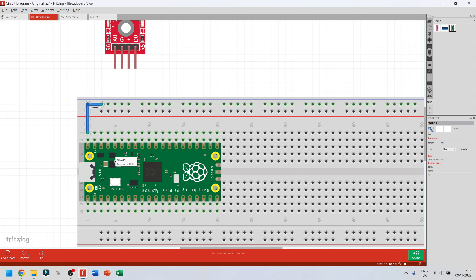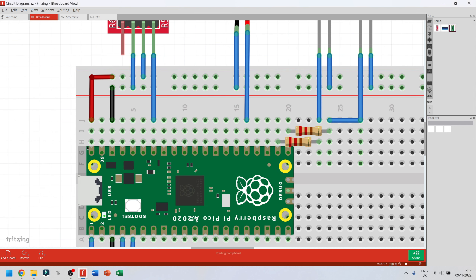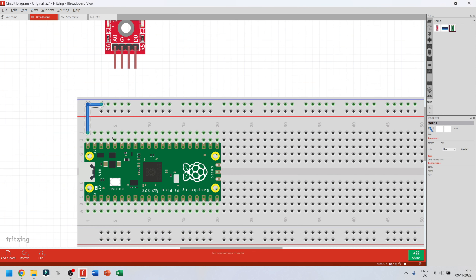I'm going to do exactly the same thing for the ground pin. The ground pin is the third one in from the USB port — one, two, three. On a breadboard, everything is connected vertically. I'll click and hold on that third pin and move it all the way up to the ground rail.